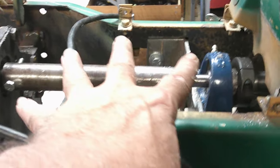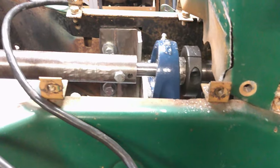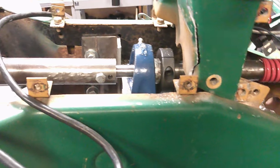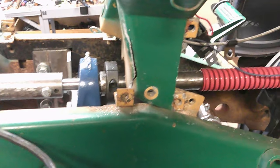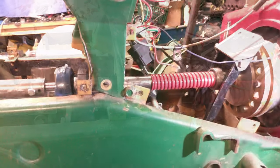What we're gonna do with that crack I don't know — that's cast aluminum. I don't know if I can possibly take it to my daily job, clean it up, and put some spot weld aluminum on it. The plate that fills in this area will have to be cut back some too. Hey, it's the price of pain for customization. I'm going to go ahead and get this hole drilled and the one on the other side drilled, and get it kind of bolted in place temporarily, then move on to the next part.